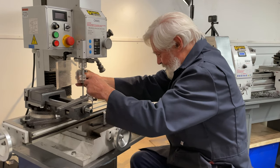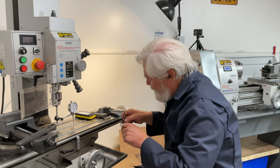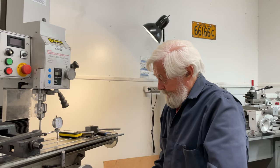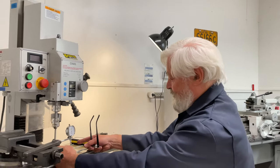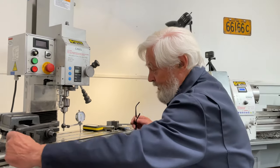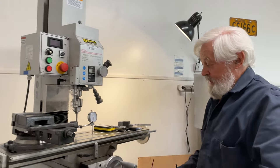You don't want to run the indicator in the groove, so you lift it up and drop it down again. And that's set at zero right now. Now let's see what we get when you swing it around. You don't want to run the indicator in the groove, so you lift them up and drop it down again. We're within 2 thousandths. That's not bad. You can get that more accurate — you can get it within a thousandth. But it's not really necessary. Although this is only over about a 10-inch distance, that means over the entire bed — roughly 33 inches — you would have three times as much, so a difference from one end of the table to the other of maybe 6 thousandths. That is not going to hurt at all for most things that you do, even fairly accurate things.